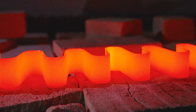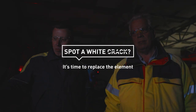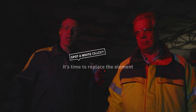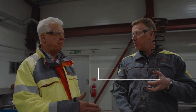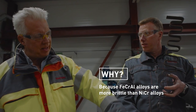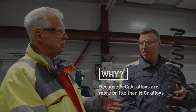Okay, so obviously it is becoming towards the end of its life. I recommend that if you have seen any white spots on the elements in the furnace, it is looking like it is time to replace the elements. We formed our strip today. The most important thing we can take away: we must preheat the Kanthal alloy strip before forming it. Then you get a very nice form of the bends, and then you get an impressive element to use in your furnace.